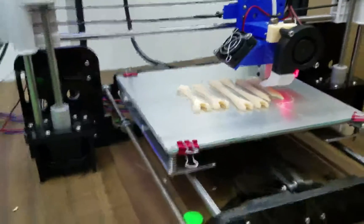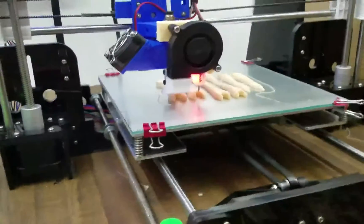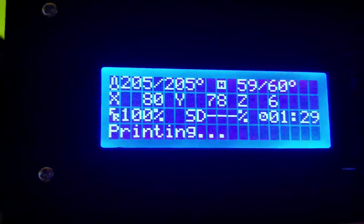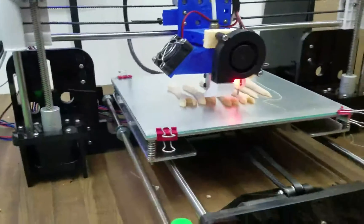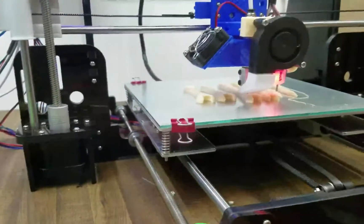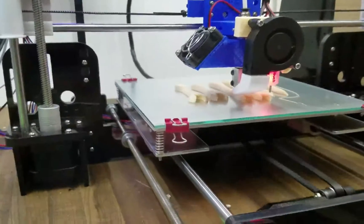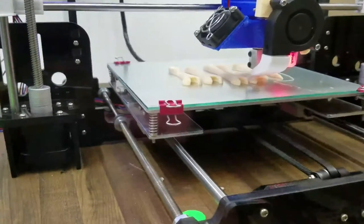One of the keys to printing on glass for a successful print is to have it hot enough, because you're losing a little bit of heat going through the glass from the heat bed. For this PLA I run it at around 60 degrees for the hotbed - it's very important for it to stick to the glass. Another advantage of glass is once it cools down it's very easy to remove - not as hard as from tape or other surfaces. I love printing on glass and it's extremely cheap.